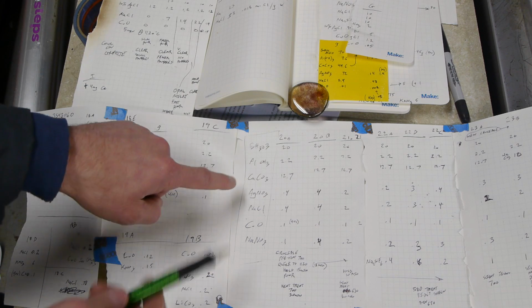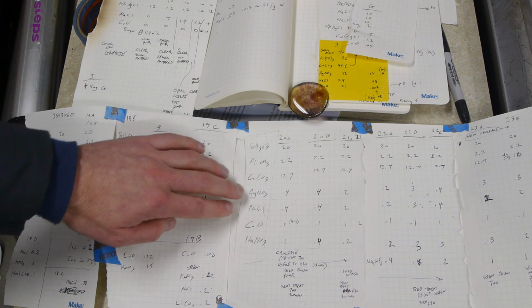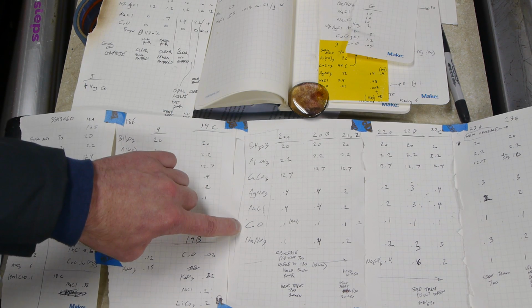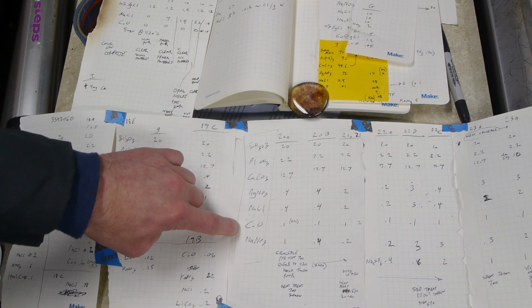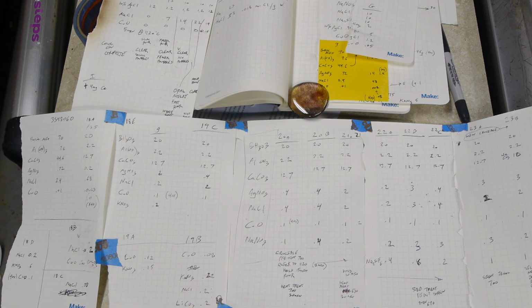And remember that the silver is going to volatilize at a different rate than the other things are. So if you're trying to control the ratio between silver and copper, for example, and the copper is not volatile or only a little bit volatile, and the silver is really volatile, then there's this very narrow process window. And so it's a lot of tweaking, and I've made probably 50 batches of glass over the last few months, and found the process to be kind of fun, but also maybe a little frustrating. But I guess that is part of the fun of it.